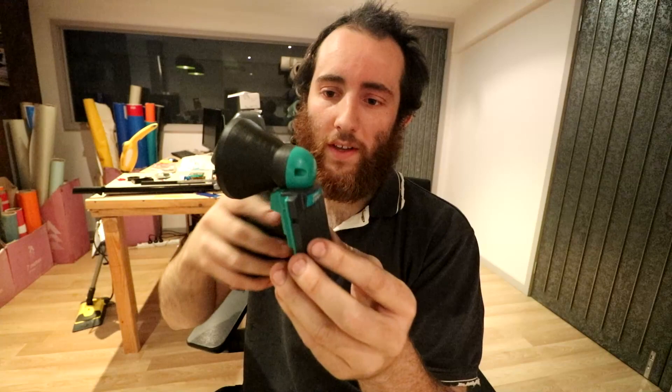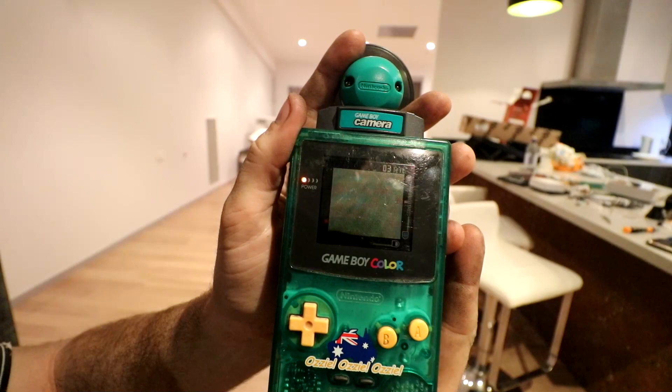Version 2. The green dome fits. The sensor is now 1.5mm closer to the back of the lens, and the lens actually locks on properly without getting jammed. Testing time. It works now — I can actually focus. There's a weird point in the middle of the zoom travel where it doesn't focus, so I'm guessing that's probably because my distance is still slightly off. I was reading some camera forums and they were saying 0.2mm makes a difference. But also it's only 0.1 megapixels, so maybe 0.2mm doesn't matter.